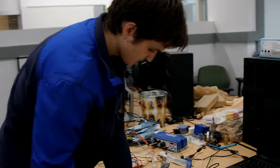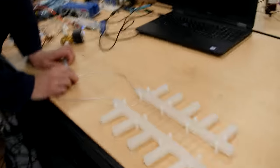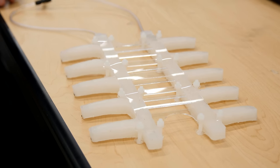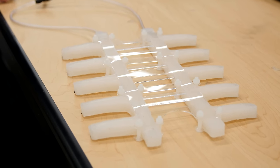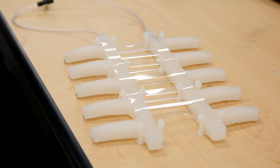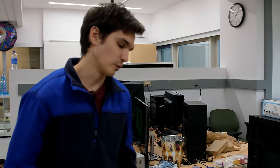You use the compressor to build up some pressure, and then it sends a wave through the robot. What we're trying to show here is that you can have a single inlet of pressurization, and then using the foam inside with 50% porosity — 50% open space — you can create an amount of fluid resistance, and with that you can create a sequence of actuations.